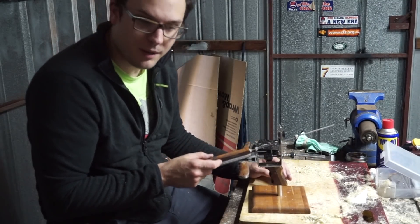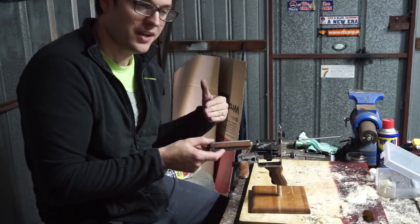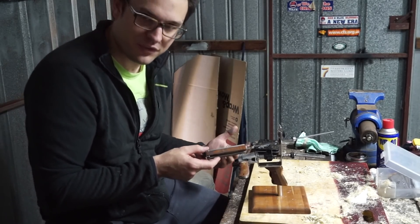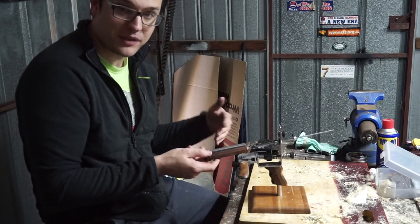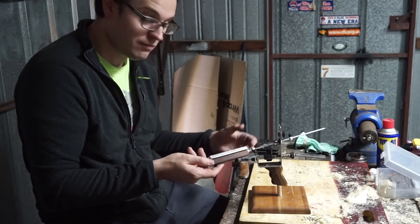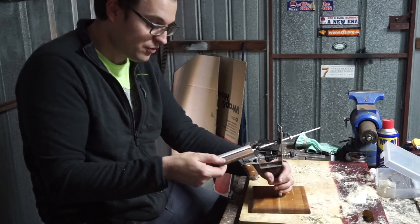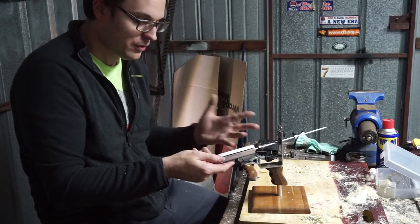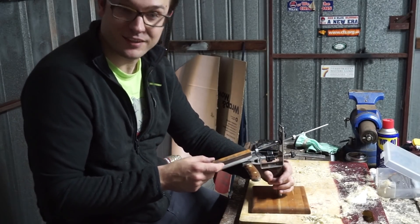Knowing what I know about D2, I'm going to actually test it at 600 grit first and then see if it does better when I take it to a high polish after that, because D2 is apparently a little different — people say it's better with a coarser finish. So 600 is not crazy coarse but it's still better than mirror polish for example. I'll just get the bare edge done and then I'll do a first test. I think we'll make it a double feature — how does that sound?